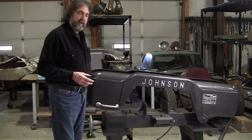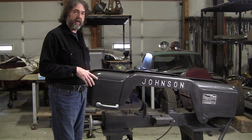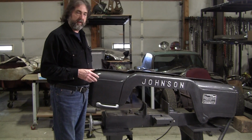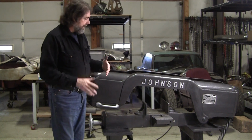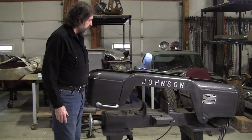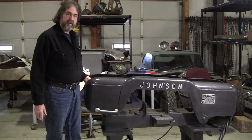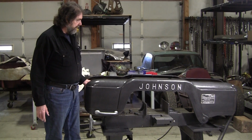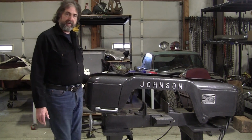of the vise. And this is the size of saw you actually need in order to cut 4 inch square tubing. A smaller saw just won't do it, because when you do the angle and you're going to do the 45, you have to have a much larger saw. So a lot of times people will overlook a saw of this size, but it really expands your capability when you buy them. And this was an expensive saw when it was sold new, probably in the 60s and 70s.